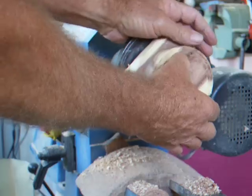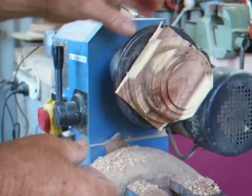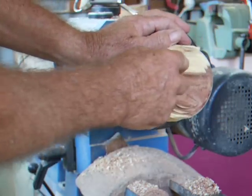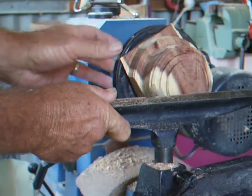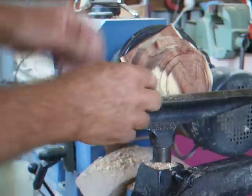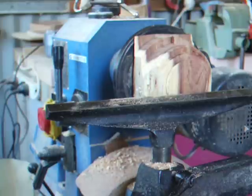When it hasn't been hard enough timber, the chuck jaws don't hold it. But this is very hard timber. I'm only concerned about this side here — it's a bit softer because that's the sap — so I might just take that down a little bit further to get rid of some of that. I'll square it up and then put the chuck on that part of it.